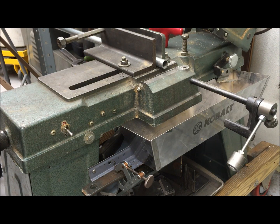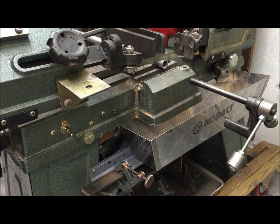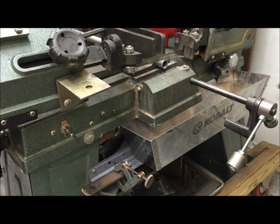If you do thin-wall cutting, then having the hydraulic cylinder able to slow the cut is great — you just set it, walk away. I'm not looking to reinvent the hydraulic cylinder; I think it was perfected a long time ago. But I don't do a lot of thin-wall, and typically what I'm doing is hand-lowering the blade.